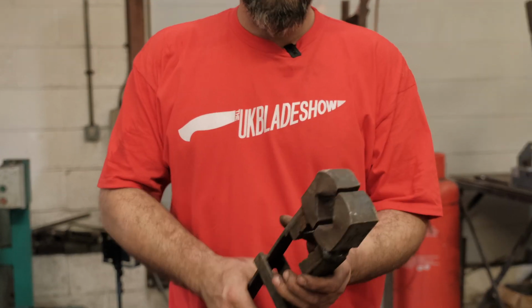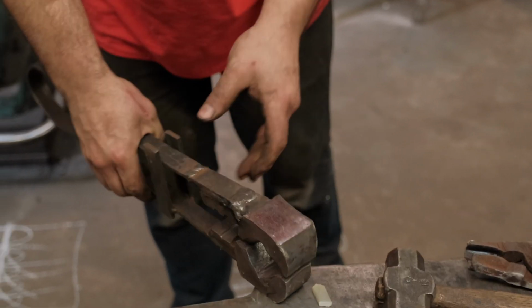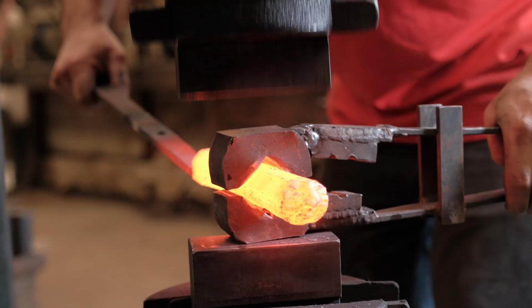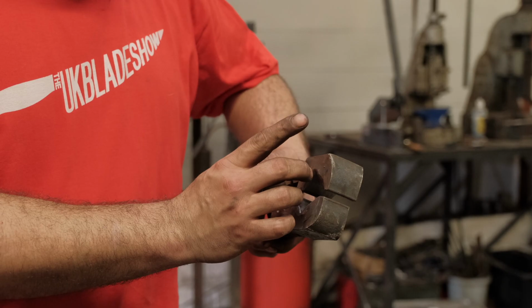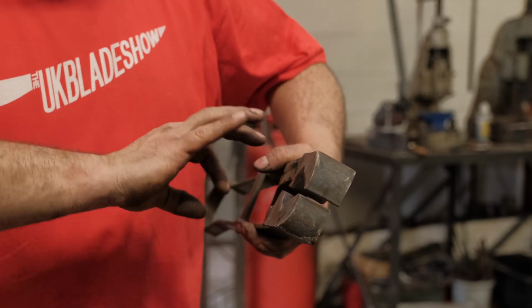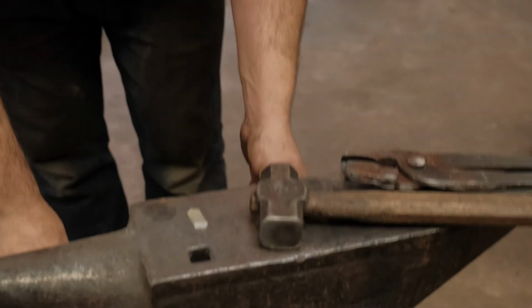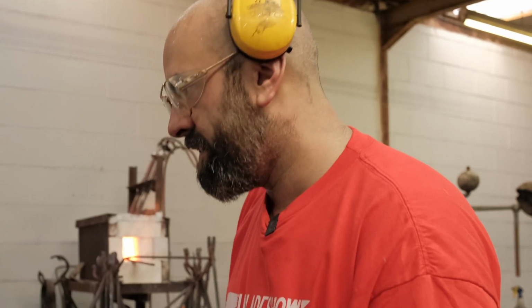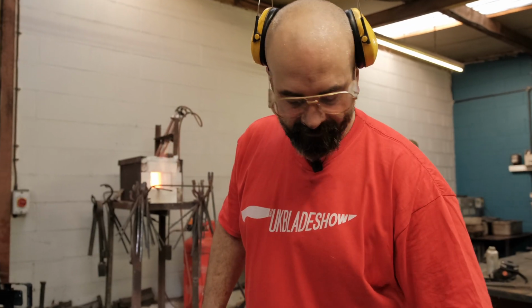So the technical bit, basically, to get the initial pattern that I want, I need to work from a square, fairly big, spring swage. So my spring swage is square, and that's going to help tuck in the corners and push everything back together so the welds don't split. As you tuck in the corners, it should move the material around all the way in the middle, just to where I want it, to be able to create this W pattern. Once I've got the W pattern, it's all smooth sailing from there, basically. Should be anyway.